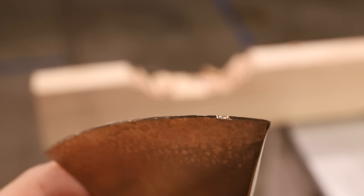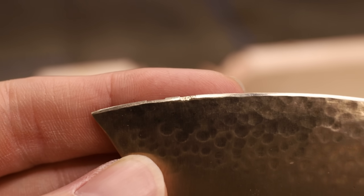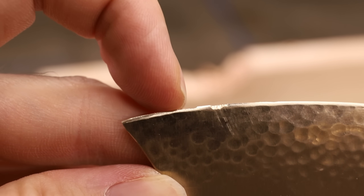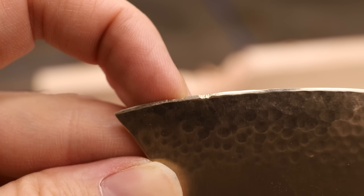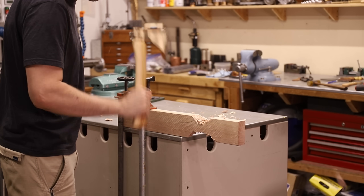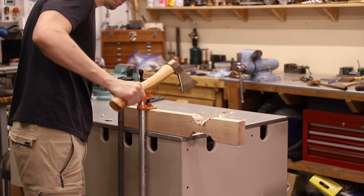It seems that this one held up just a little bit better than the tin bronze, and that's not a surprise. There are a couple small chips at the edge, and that's actually from when I cold forged it. There was a little bit of porosity in this area and when I was cold forging it, that caused tiny cracks to form and that led to the chipping. But even though it did chip, you can see that it didn't actually bend or roll over at all — the remaining metal is still intact, and I think that's really impressive.